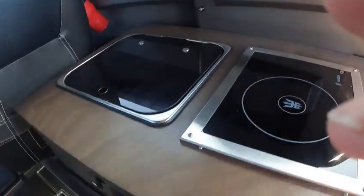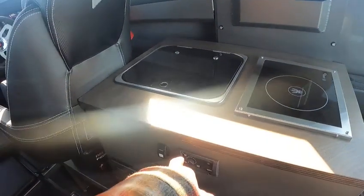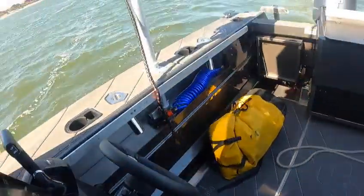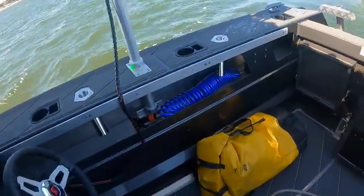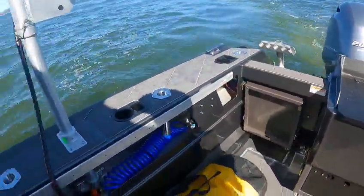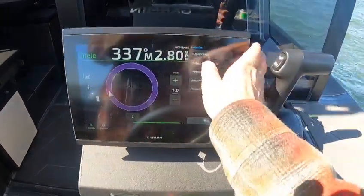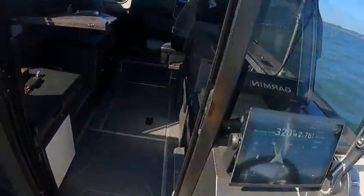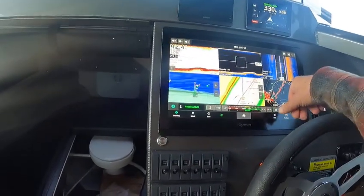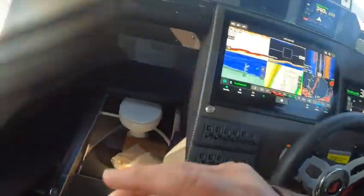You want to see red — don't touch it. To get it off, push this again until you see the lights flicker. Let it do its thing — it's going to go off, start blinking, then go off completely, and then you can shut your batteries off. With this wind I'll take the steering wheel — the autopilot's got a mind of its own. I'll go back in here, hit engage, heading hold — it's going to take me straight on. I can hit 10 degrees over a couple of times, then leave it.